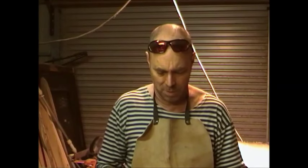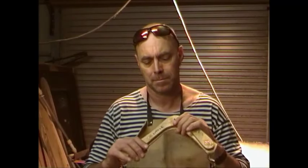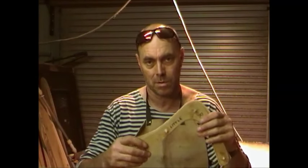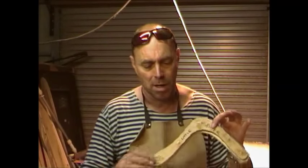And to get that profile shape, what I do is I start out by marking out my plywood, obviously multiple things on my template. I mark out and then I cut out that basic rough shape to put on my routing profile template. It has little location pins. And you notice for right-handers, which are 14 out of the 15 throwers you'll find around the place, I have my template marked out back to front, if you like.